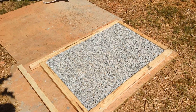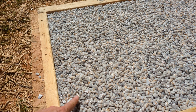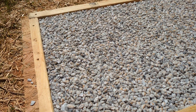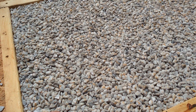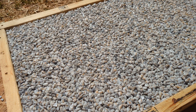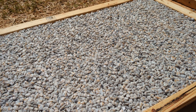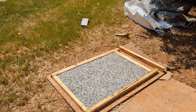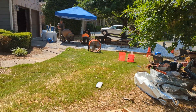This is a sample — it's got a little dirt on top from the trowel. We use an old trowel; we have to buy brand new trowels every time we do this. The actual finished product won't have this rust color on it. It's only been sitting here about an hour and it's set up nicely. It takes 24 hours to set up solid. Then after you mix it, spread it, and screed it, you roll it with another coat.